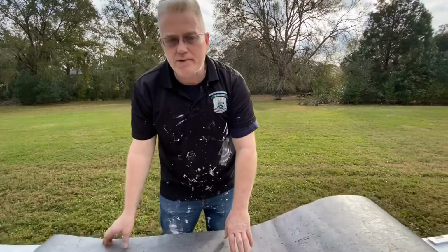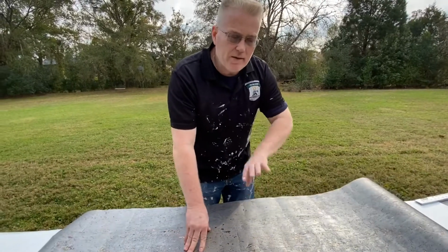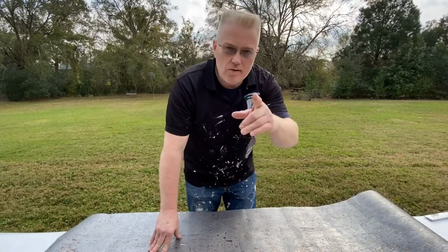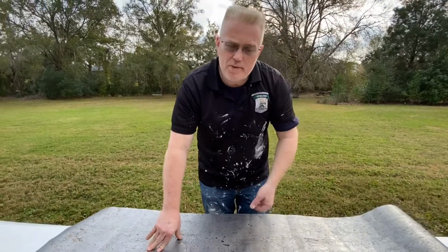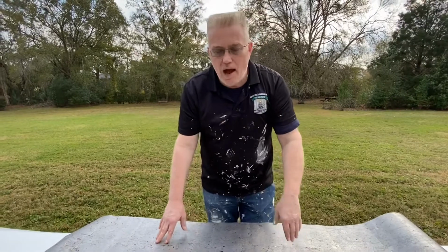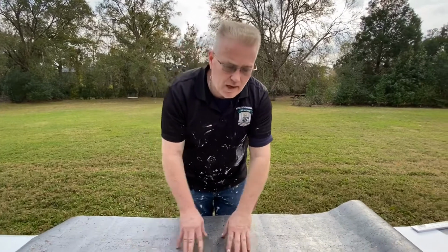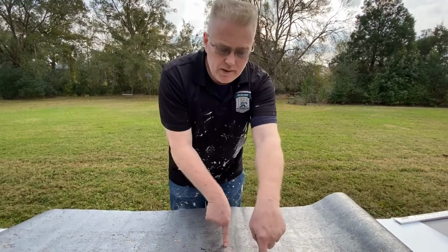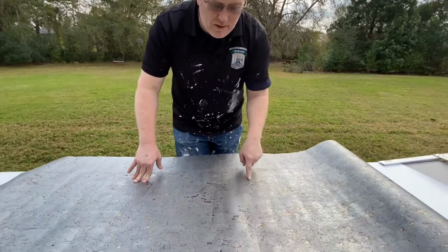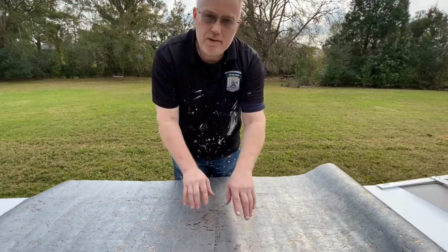Did you know that when a carpet installer cuts his carpet, he makes sure that the pile is facing in the same direction? Because if it's not, it'll look like two different rugs. And you know when you vacuum your rug, when you pull that vacuum back, right? It looks like a different color, right? There you go, folks. I don't want to beat a dead horse. I'm trying to explain, because a lot of people don't understand why wall covering needs to be reversed every other sheet. In fact, if you have a symbol on your wall covering and you see one arrow going down and one arrow going up, that's your cue to reverse every other panel.